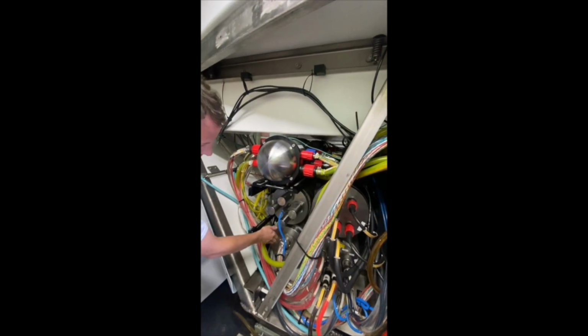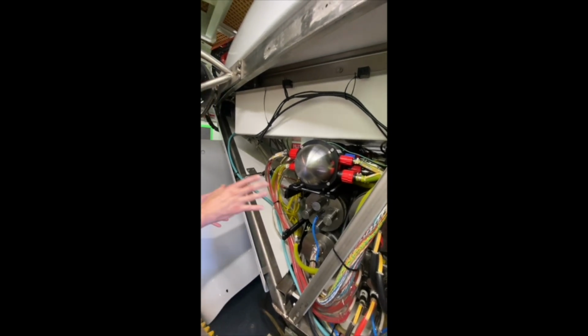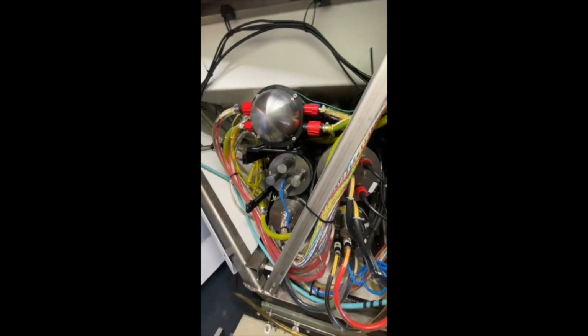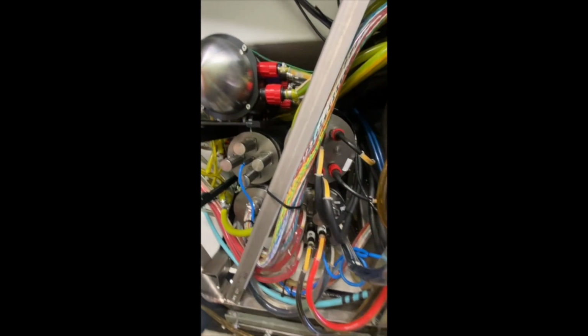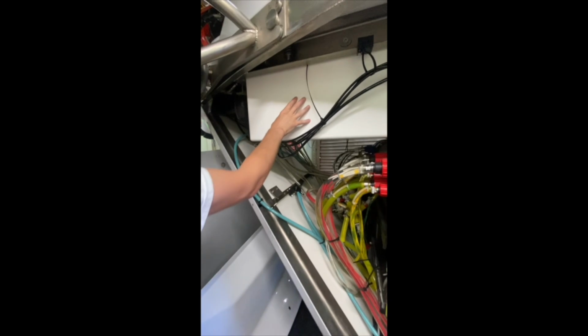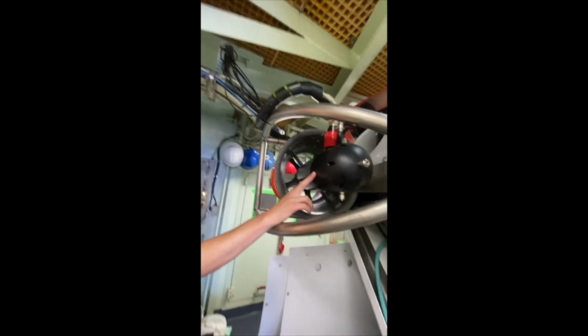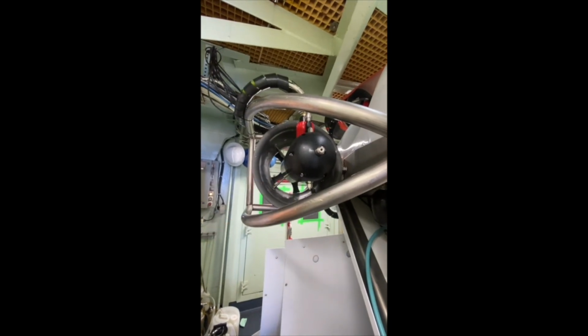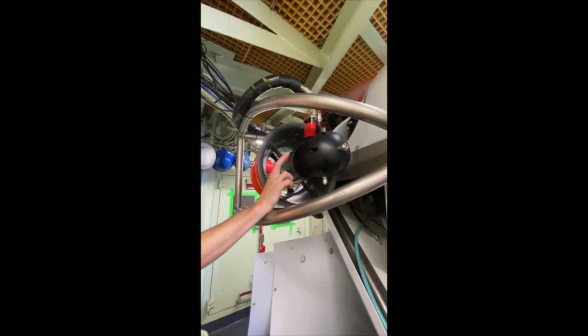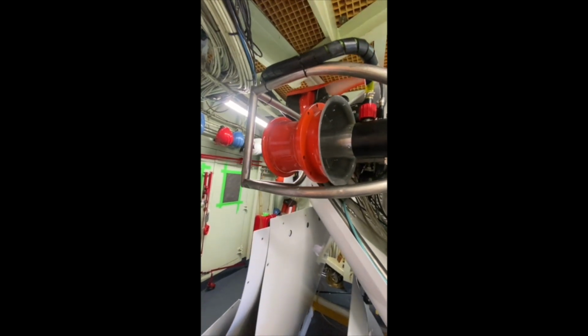The other cylinders you see here are also pressure tolerant for 6,500 meters, and that's where we package some of the electronics that can't be immersed in oil. So the ones that have to stay dry are in all of those canisters there. Another look at the syntactic foam. This is a block that's uncoated, but you can see that we hide foam in a lot of different places. Right above us here are the new propulsion and electric motors. Like I said, the hydraulic pump is run by the same motor that drives the propulsion. So those are all new for 6,500 meters.